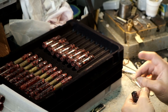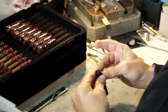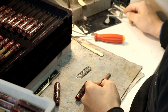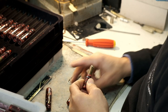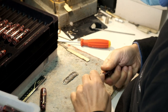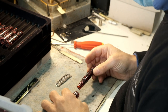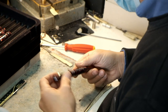It starts with the clip being attached to the cap, which is an important step because it also determines the position of the barrel. After that, the ring and barrel are attached to the grip section to become one solid part. Note that the different resin parts are selected to match each other based on the pattern in the material. As you can see, the famous barrel engraving — where the name of the company and the edition number are engraved — is precisely aligned with the clip.